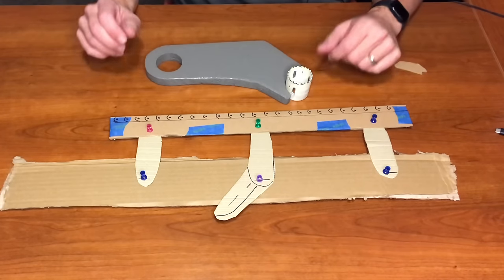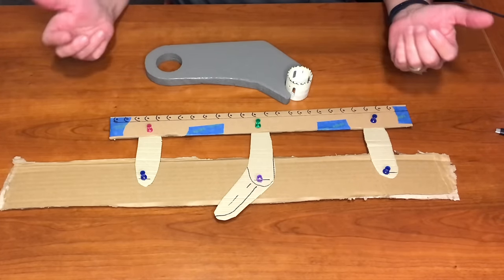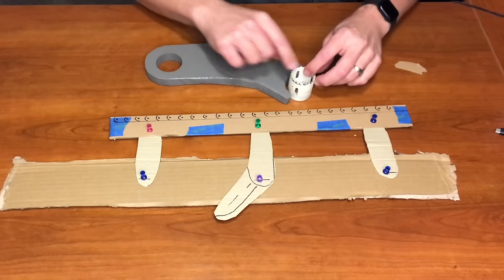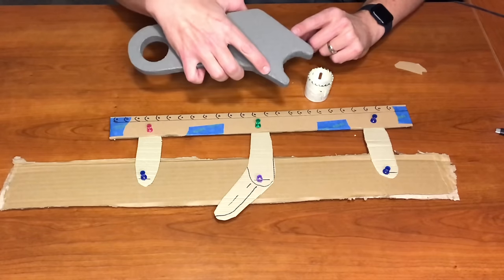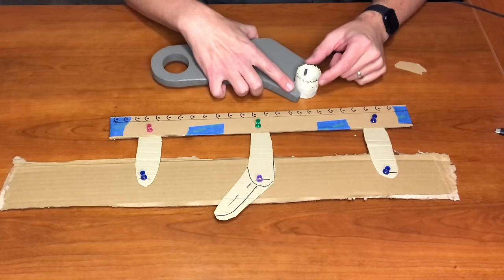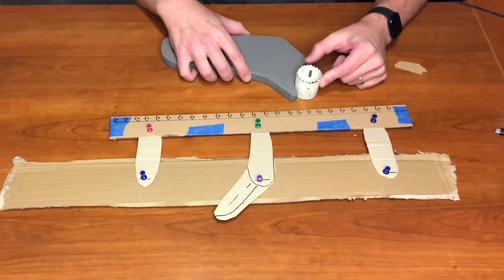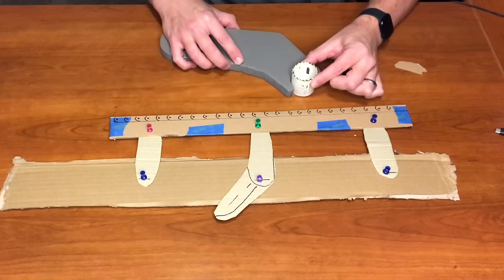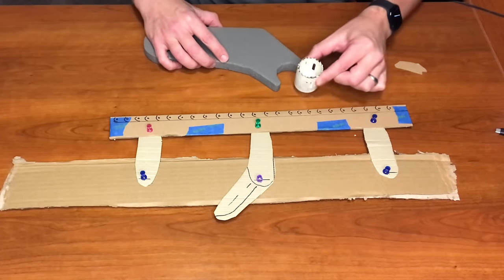Now, how does the train drop off of a lift two? That's the big question. Well, the easy answer is you simply take the chain itself and you pull it down really hard. Unlike most chain dogs where this bottom lip is actually trying to work really hard at holding the chain, on the boomerangs, they're not so much there. They're more straight up and down like that. So when you try to pull the chain out, it's really simple just to pull the chain straight down instead of having to move the dog forward and then take the chain down.